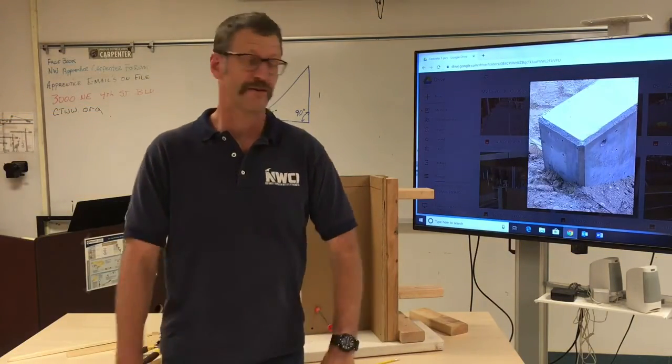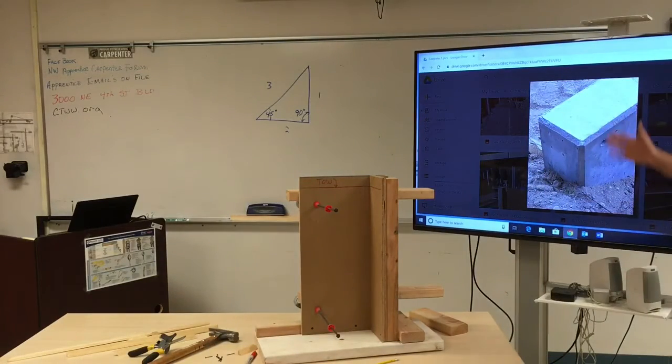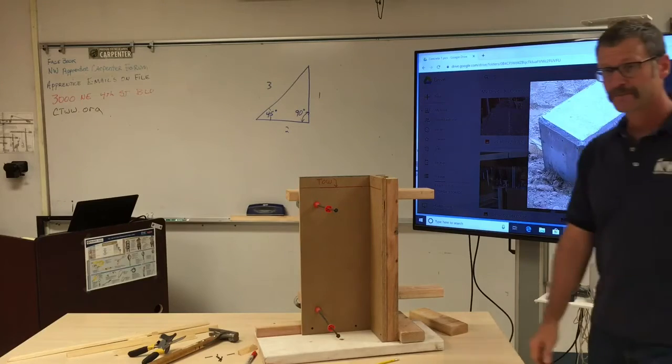How many of you have had to cut a three-way intersection? Where you've got a concrete wall like this, and a bulkhead to stop your concrete. Typically you're going to have a piece of chamfer here, then your top of wall elevations, and two pieces of chamfer that intersect this vertical piece. How many of you have had to try cutting that intersection? How many of you have been frustrated with that before? Yeah, me too.